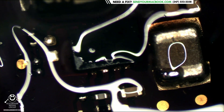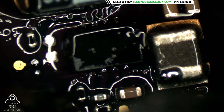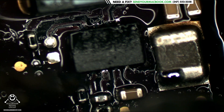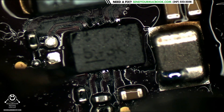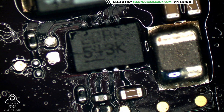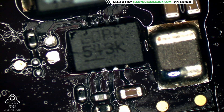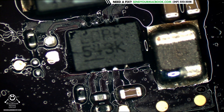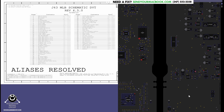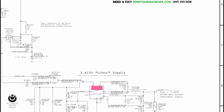After this I imagine we will get a consistent 3.42 volts on our PP3V42. Now this area where there was shorting is right around where feedback is. Katherine Hauserman in the chat was so kind as to help organize a document that goes over a bunch of basic things on basic electronics. There is something called feedback where the chip is going to want to see what it is doing — this chip is going to take 18 volts and turn it into 3.42. Let's find the PP3V42 chip, U7090, in the schematic and board view.